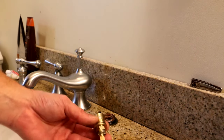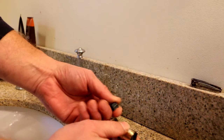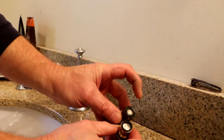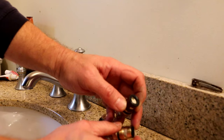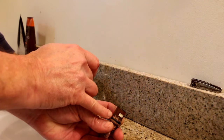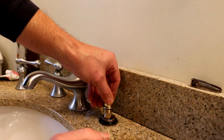All right, now I'm going to install the new cartridge. You're going to make sure you take out this rubber piece right here. The design looks a little bit different — it's a lot wider seal they put on this one than this one. I see what happens when you screw this in, that compresses down. You can see this little o-ring right here — that would be what could cause it to leak water along the top. Of course, it also could be leaking along the stem itself, this moving part. I'm not going to worry about it because again, it's an entire assembly that gets replaced in one shot.